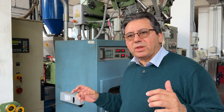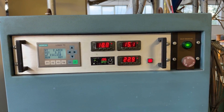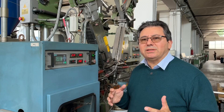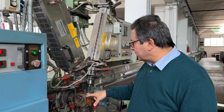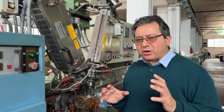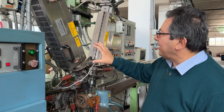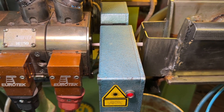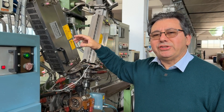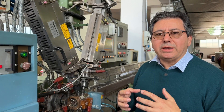If there is any sort of imperfection, the machine will stop immediately. Over here we are making a short circuit, so we are raising the temperature of the wire up to 100-110 degrees Celsius, because when the solid core or the stranded core enters the extrusion head it has to have approximately the same temperature as the extrusion head. You can see the extrusion head — there are one, two, and three extruders which are extruding at the same time. Let us go behind and show you the bigger one, the one which is making the foam dielectric with a physical high-pressure injection.